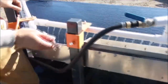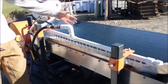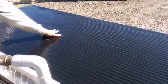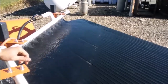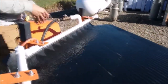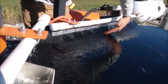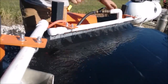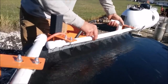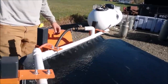The feed water bar needs to have fairly even water coming out of the holes all the way across. Looking at the shaker table top, you can see the water flow is nice and even with hardly any turbulence on the surface. The water is flowing down the ramp towards the number three and number four ports. The cleaning plane water bar is tilted back just a little bit so streams of water hit high on this little ramp, which allows the gold or dense material to come up and make a line right at the bottom of the ramp built into the shaker table top.